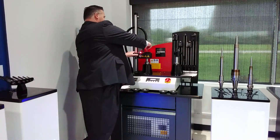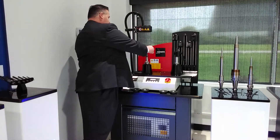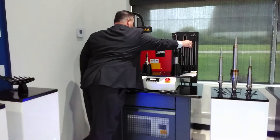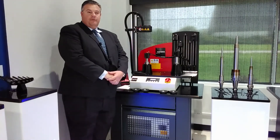Just a few seconds to cool it down and you've removed your cutter. This is a preset cycle, so it doesn't give me an opportunity to overheat the holder. There's plenty of time to put your next cutter in, and there's plenty of travel on these cooling bodies so I can bring the cooling body all the way over to the heating station and put it over the holder.